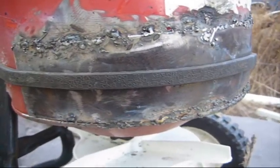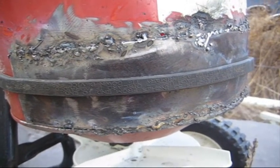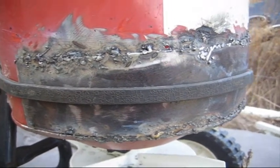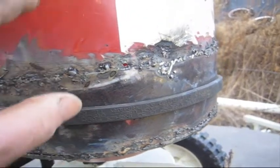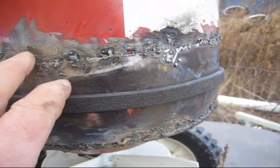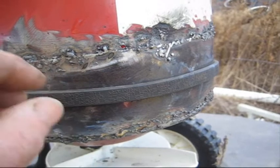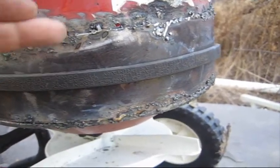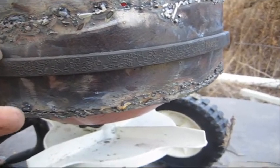I'm back and I wanted to show you a finished project but unfortunately it just didn't work out. I was using a Harbor Freight 90 flux core welder, which I'm not that good with, and in this case I wasn't good with it at all. This metal is kind of thin and the patch metal is a little thicker. Normally you get a lot of splatter but I was getting more than usual. What was happening when I hit the trigger — the wire would come out and stop, come out and stop, then it just stopped altogether and the wire just wouldn't feed.